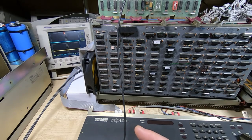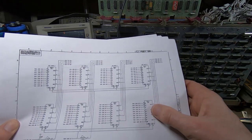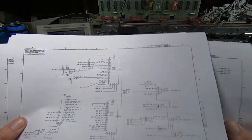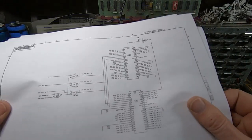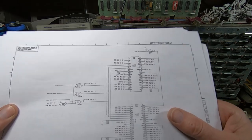If you're not familiar with the RX02, it's a very difficult machine to fault find on. It's got two large boards in it, and one's the interface for the drives. It provides the analog signals, stepper drivers, that sort of thing. And the other one's what's termed a CPU card. It's not really a CPU card unless you look at it in terms of the entire board being a CPU. What it really is is a set of ROMs, and through various multiplexers, sequence generators and a lot of glue logic, it provides a hard-coded state machine.